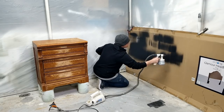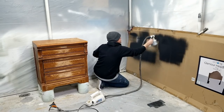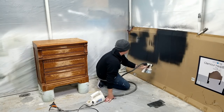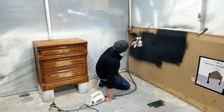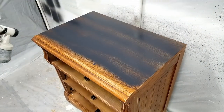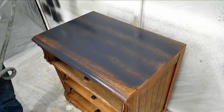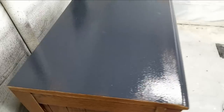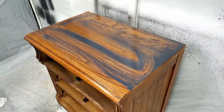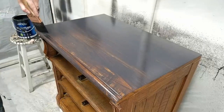It's really great to practice your technique on cardboard before you attempt to do it on furniture. Even after all that practice, I still had problems with the spray pattern. I also felt like it was splattering too much and creating an orange peel effect. So before it had a chance to dry, I sprayed it down with water, wiped it all off, and after all this frustration, I decided I was just going to do it with a paintbrush.